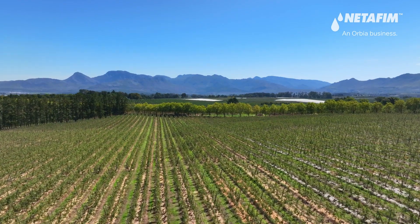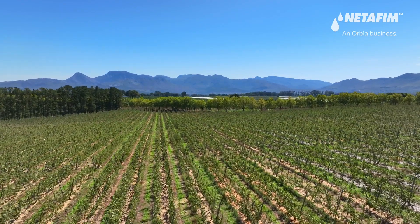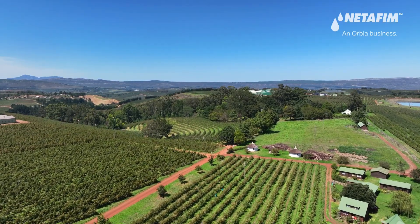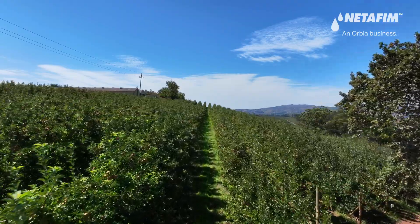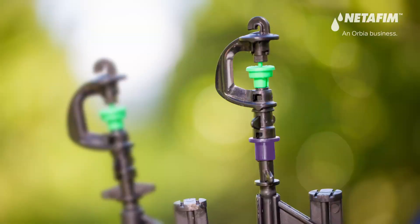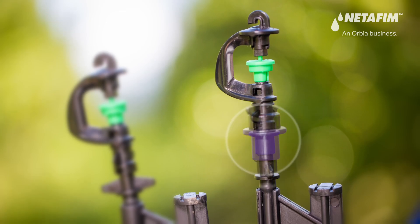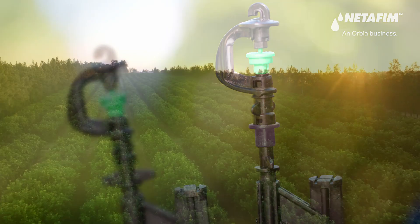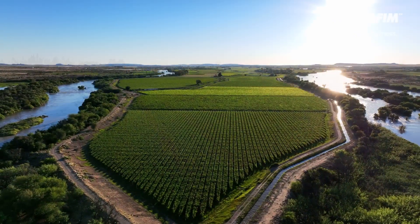With decreasing tree spacing, as is common in many orchards today, we need decreasing flow rates as well. Runoff has been occurring in some soils with lower infiltration rates. The 15-liter-per-hour adapted micro sprinkler has been able to overcome this in certain cases, allowing GyroForce to be applied across a wider range of crops, areas, and circumstances.